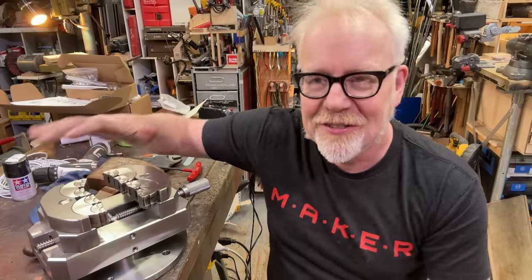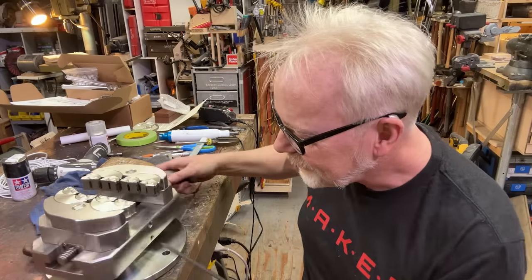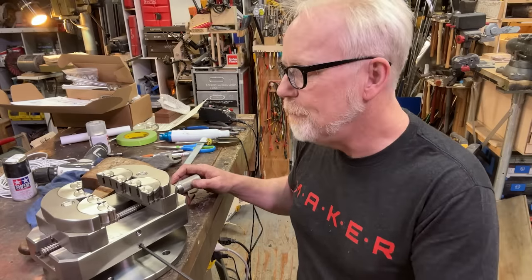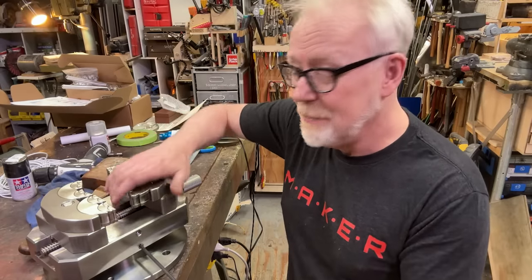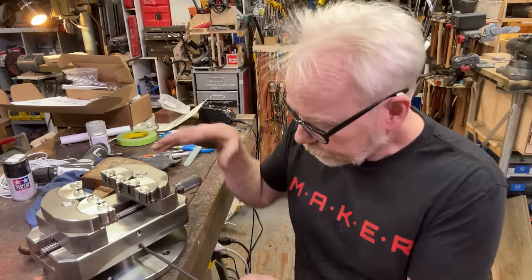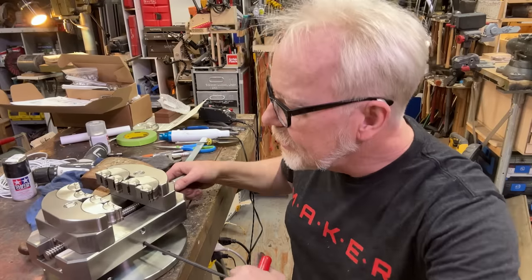There will be more to do with the fractal vise, but for right now, we're just going to enjoy it. It's just such a beautiful thing. Oh, and it pivots really nicely. You want it to pivot because you want to be able to lock something down and then choose your angle of attack on the mill. It's a big pain in the butt to load this up on a rotary table if it's unnecessary. So fractal vises always have a turning aspect to them.